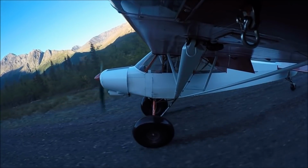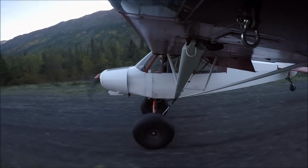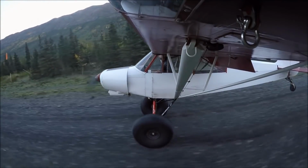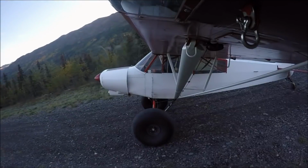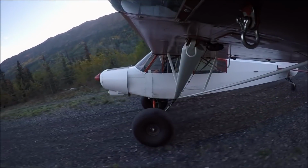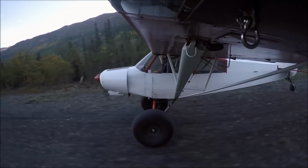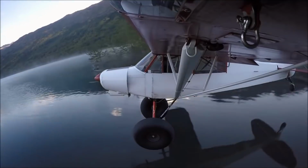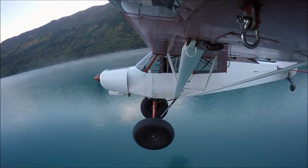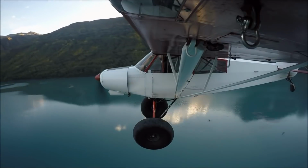One thing I thought was very innovative about this, because when you talk about adding a piece of equipment to any aircraft, but certainly a certified aircraft, it's a big deal how it attaches. So this appears to just be bolt together, is that correct? Correct. Like all our products, we try to make it easy for the customers to install. So we kept the same attachment points as the original landing gear. So it takes like one day of labor just to replace. It's a bolt-on conversion.